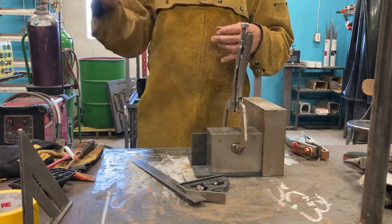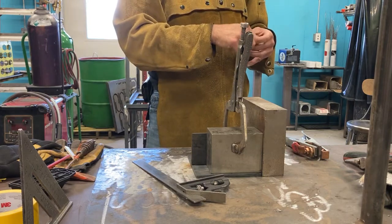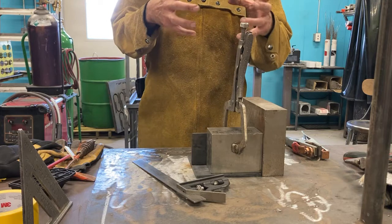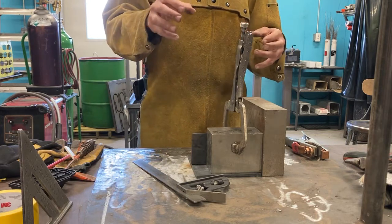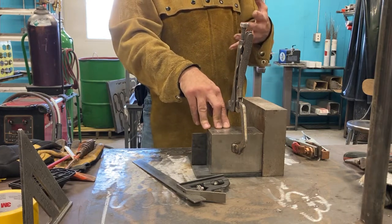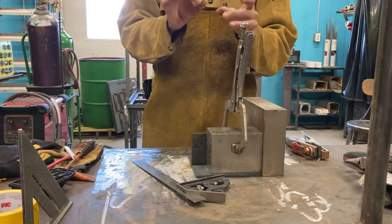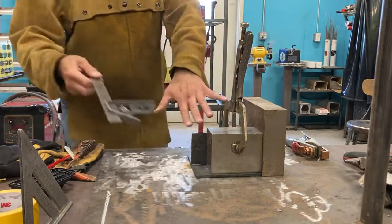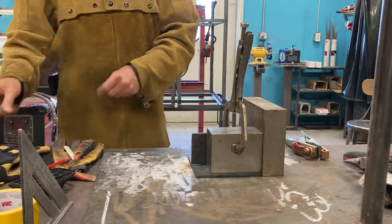If you haven't seen it, go back in the weekly units and watch the video. It shows you beautiful film of very strong magnetic fields near welding arcs, and it's pretty eye-opening. It is a problem in stick welding. It's a horrible issue in TIG welding, and you'll see that when we get to that point, because it's very delicate and very subject to magnetic fields moving it around. So now I know this is not going anywhere. I like that. So let's tack it together.